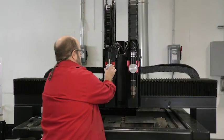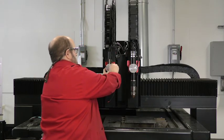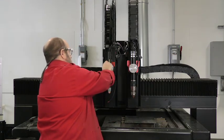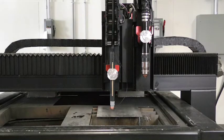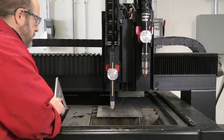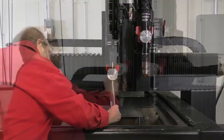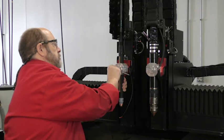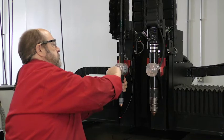Install the Powermax Sync mechanized torch into the torch holder. When installing the torch into the mounting bracket, make sure it's straight and level. Install the machine torch perpendicular to the workpiece, using a square or digital level to align the torch at a 90-degree angle. Position the mounting bracket lower on the torch to keep vibration at the tip to a minimum. Don't over-tighten the mounting bracket, as too much force can cause damage to the printed circuit board inside the torch or damage the torch shell.